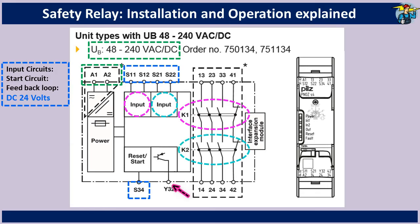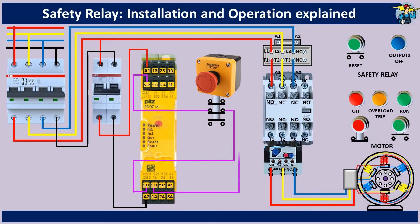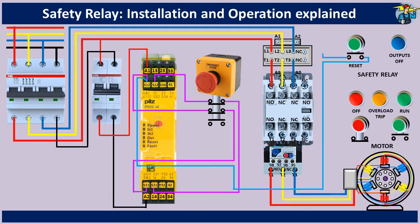Y32 is for the PLC, that is the programmable logic controller input terminal. Let's go back to wiring work now. Connect S11 and S12 terminals through one set of NC contact points on the emergency stop switch — this is input channel 1. Then connect S21 and S22 through the other set of NC contact terminals to enable input channel 2. The reset switch needs to be wired in between S12 and S34 terminals, and also required to go through the two NC contact points on the two contactors.